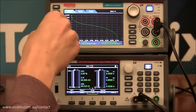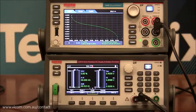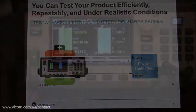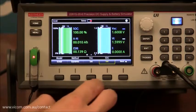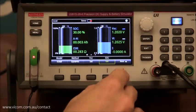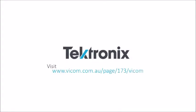In a real customer application, what you would want to do is move this flash drive back to the 2281 and go through the import process that we went through in the beginning. Now that you have the model loaded into the 2281S, you can use that model to test your device efficiently and repeatably at any state of the device. For example, I can set the state of charge of the battery to 30%, and now the 2281 will represent a 30% charged battery. Thank you for watching. For additional assistance, contact your local Keithley application support person.